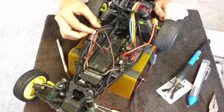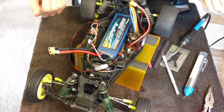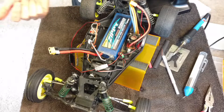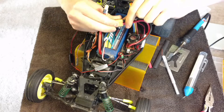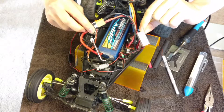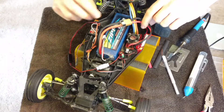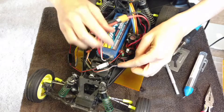This is going to go into our receiver — plug that in. Now that we have everything connected, we're going to plug in our battery and check to make sure everything's working properly. Since you routed your UBEC directly into your battery, right when you plug in your battery it should power up. Looks like that's powered up — we have power to our UBEC and our receiver, and then we also have to turn on our ESC on the switch.